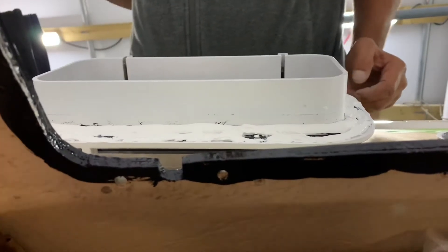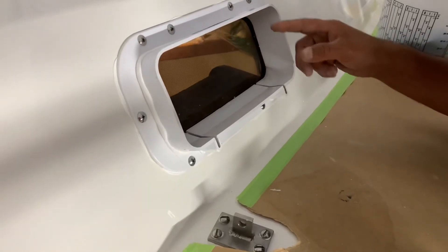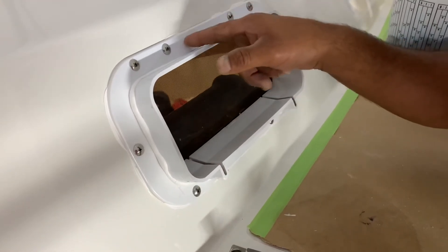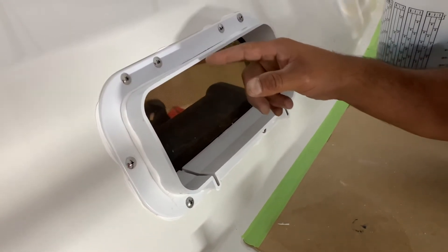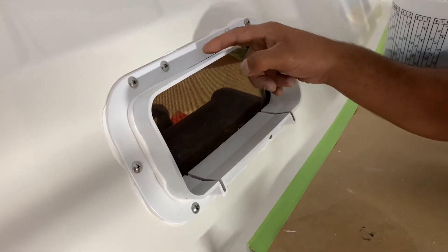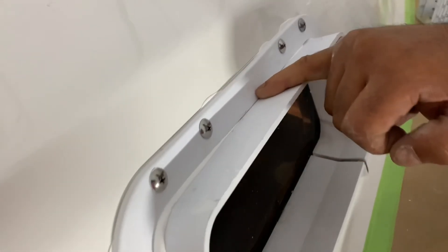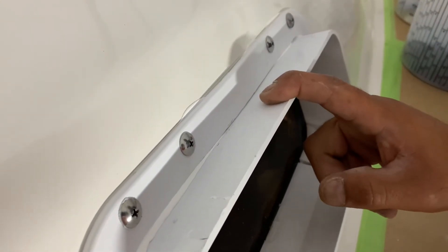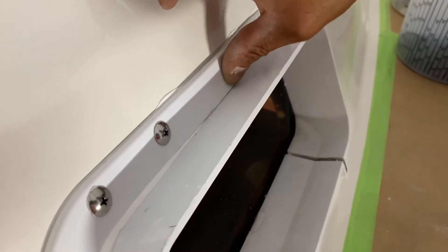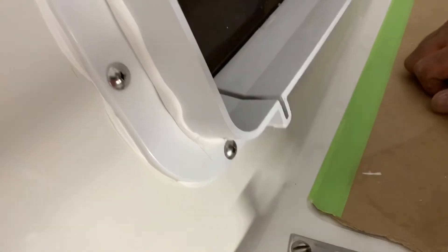The important part of caulking is to put caulking in this joint line here, because that's the cavity. Around here it's not a 100% fit — it's a little loose — so you want to make sure you create a gasket between this block, which is the primed fiberglass, and this corner here, which is the plastic. Generally it's going to leak from there or from your fasteners. You don't want caulking in your fasteners — I usually caulk around the fasteners, and by the time you squeeze it all down it creates a seal around the fasteners as well as around the fiberglass cutout.